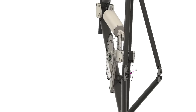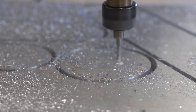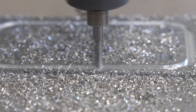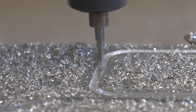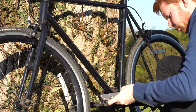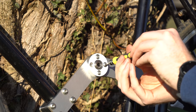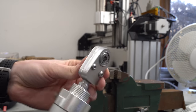When I was happy with the design it was time to CNC cut all of the parts and 3D print the frame clamps, using PLA plastic filament supplied by my filament sponsor 3D Prints UK. Once all the parts were ready and the necessary hardware had arrived it was time to check if my design would fit the bike. The bearings for the crankshaft were then added, which will be used to support the shaft designed to connect the pneumatic cylinder to the drive sprocket.